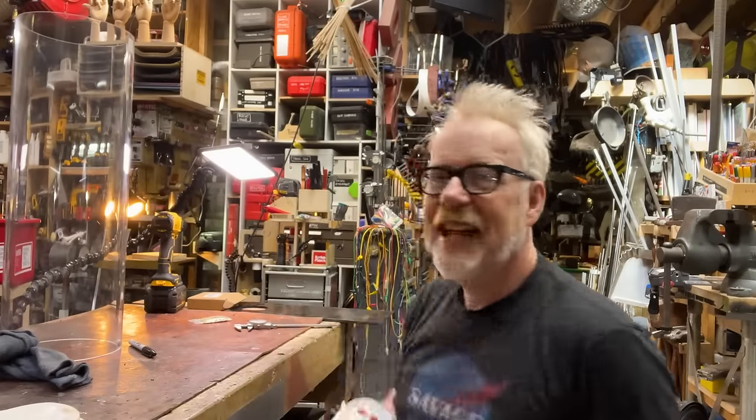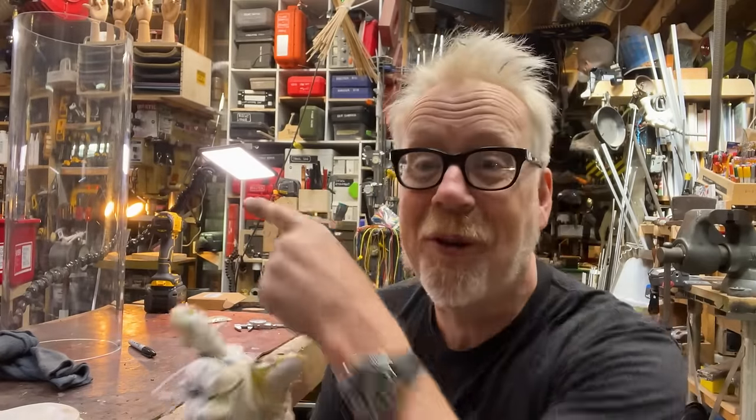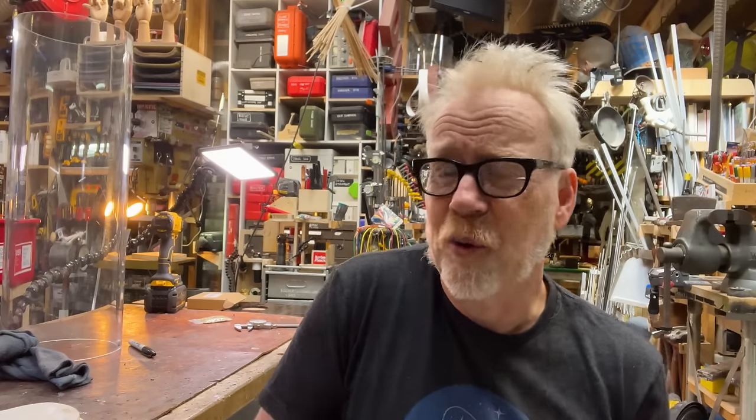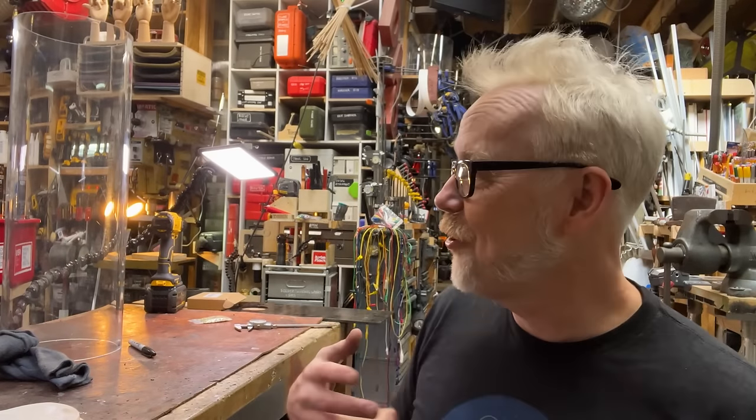And I'm gonna make a negative pressure glove box out of this with this mounted in it, so I can pull this to the negative pressure of a suit, which is about 3.5 to 4 pounds per square inch of pressure. For reference, that's about 1/3 of an atmosphere. That is the amount of pressure required to keep the oxygen molecules close enough so that you can actually inhale them and they can do work inside your lungs.